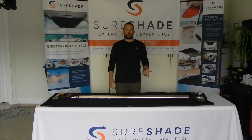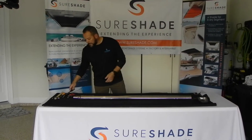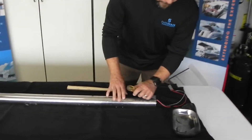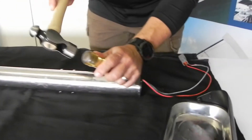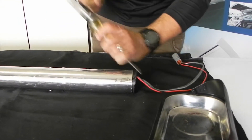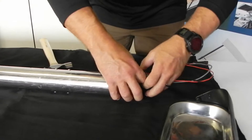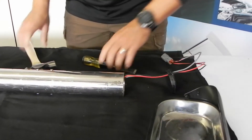The first thing we want to do is pull the motor. I've got a video on how to do that. The only thing you're going to need is a hammer and a small chisel. You want to take a very blunt angle on it. Pop the cap off. Try not to pull on the wires because you don't want to pull them out of the motor.